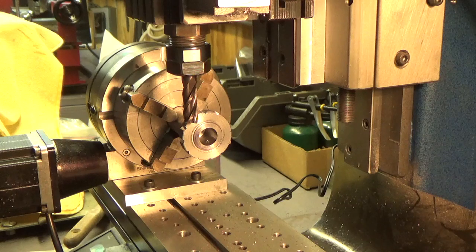If you calculate — if you draw a line across three teeth and look at the protrusion of the center tooth, that's the amount of possible engagement with the pawl. In this case, I've got a possible engagement of about 90 thousandths. We're cutting a pretty deep V down in there, but in reality we're only using the point or the end of each tooth. With 10 teeth, I had an engagement of about 110 thousandths or something. So this one's about 90-plus thousandths of engagement.